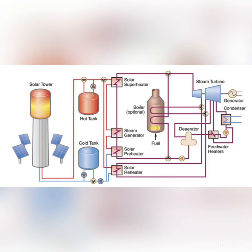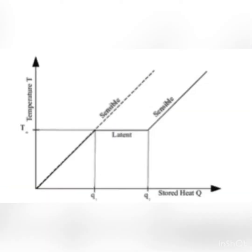One of the purposes of MGA is to move this storage volume up into the receiver itself. The way this receiver-located storage works is the storage material is located in the receiver and is directly heated by the sun, and the power fluid flows through a series of pipes inside this block. That's how it's heated by the sun, and then the rest of the system works as normal and the power fluid is heated up to create steam.